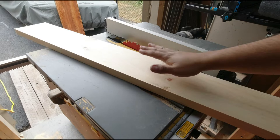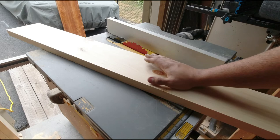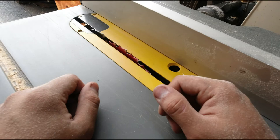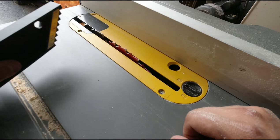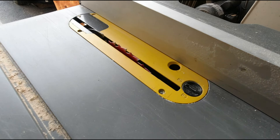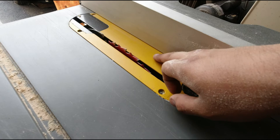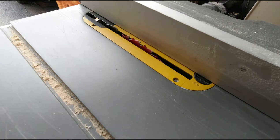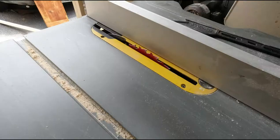Now that my stock is cut to length after ripping on the table saw, both pieces will be exactly the same measurement, which helps me get the frame square once assembled. For cutting this rabbet, I don't have a router bit big enough, so we're going to use the table saw. I've set the blade height to half an inch. For the other dimension, we want to come to three-quarters of an inch, factoring in that the blade removes material — so I'm coming in an extra eighth of an inch to account for the blade, setting the fence at five-eighths of an inch.